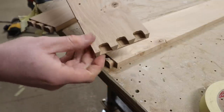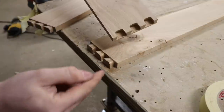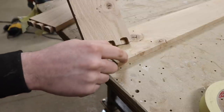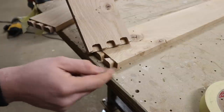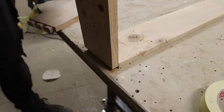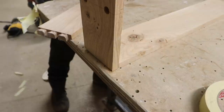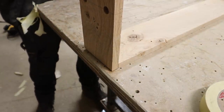Whereas if you use a runny glue like Cascamite or PVA or Titebond, what glue you get on the shoulder of the joint, when you assemble it and push it off, all it ends up doing is it just soaks into the end grain just a little bit more after that point, and the bond between this surface and that surface is really crap. And you end up with barely any glue on that shoulder and a cracked joint after the first little bit of movement that it sees. The joint's cracked. So push them together, and as you see, no glue squeeze yet.